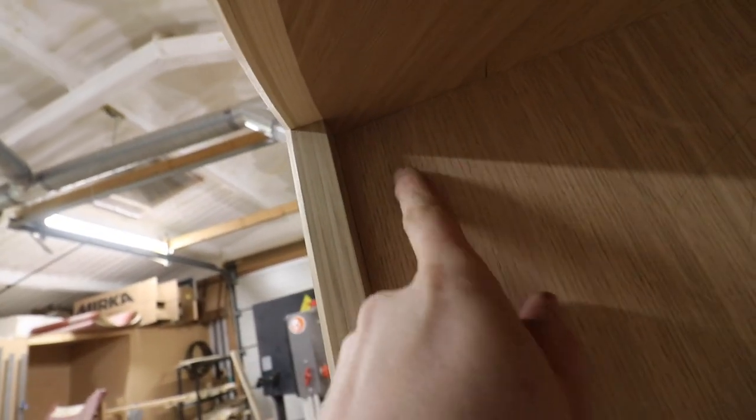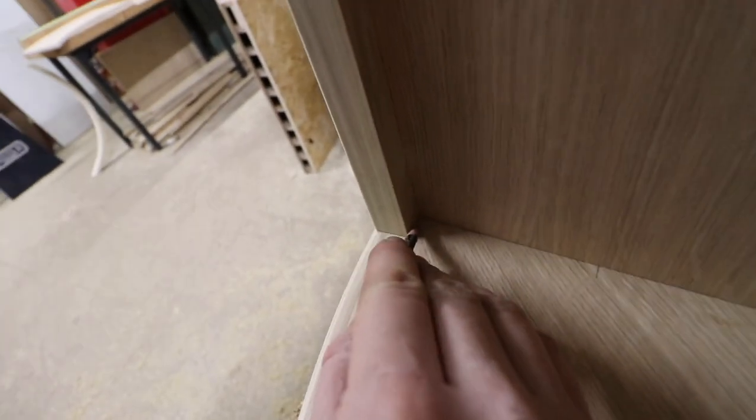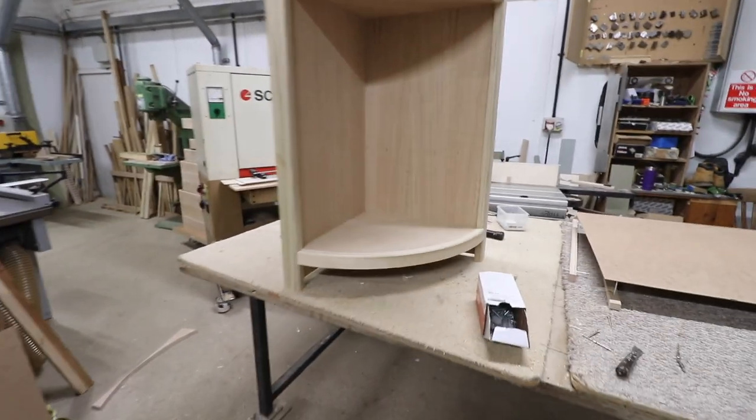This side at the top is pretty much perfect. By the time I've put some pocket hole screws in the uprights on the back, that'll be clean. To be fair, the bottom, again, probably wants the tiniest little half a mil off of there, and then perhaps half a mil planing off the upright piece, tapering to nothing at the top. But for a dry fit, I'm pretty pleased with that.